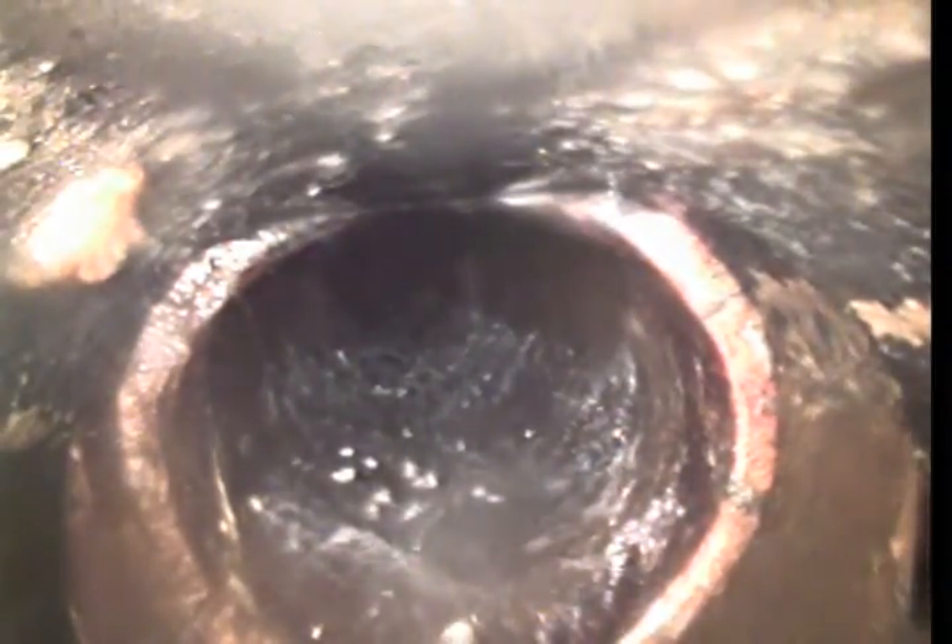This 6-inch tile will end right here. This is at about the property line, right at the sidewalk, I'd guess. And we're pulling back on the property, and everything on property is 4-inch Orangeburg — it's a compressed tar paper sewer pipe. So what we're going to see pulling back through here is some minor blistering.